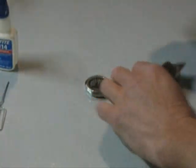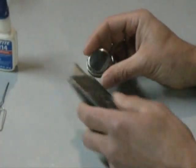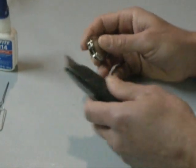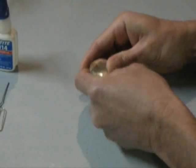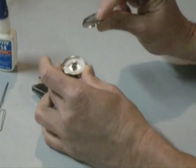First step: you're going to take your insert and look around the back side of it, and you'll see the back plate. Along the perimeter of the back plate, you'll see a little pry tab. Take the edge of your knife, stick it underneath there, and just give it a twist. Be careful not to cut yourself, and that will pop the back plate off.